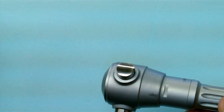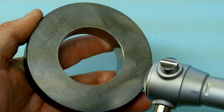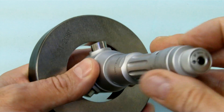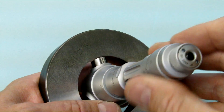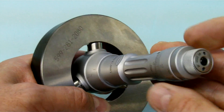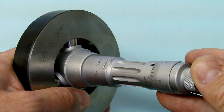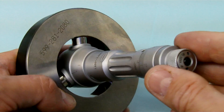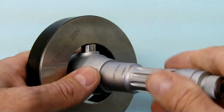It is meant for measuring bores, and this is a standard that it goes in. What I would do is turn this until it fits into the bore and then check the size — gives you an idea of how to measure a hole. It is a little nicer to use than an inside micrometer because it has that third leg, so you're not worried about whether you are over the exact middle of the bore or not.